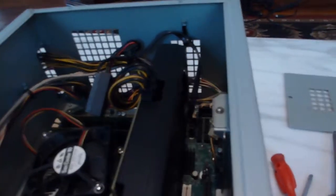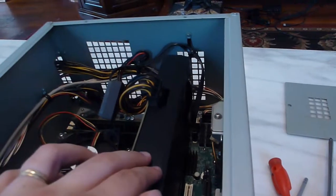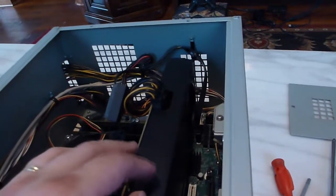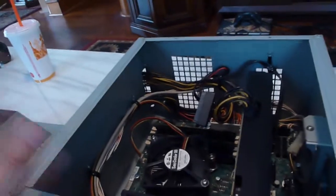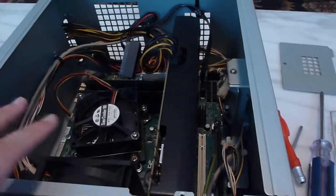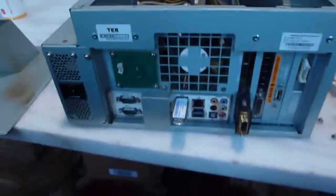It's actually a pretty impressive system considering it's an i5-3550 and a GTX 760. I'll post the specs of the video RAM when I find that online — I'll take the pictures I have and check those chips to see if it's the 2GB or 4GB edition of the card. I couldn't see Namco using something crazy spec'd out because this game runs on Unreal Engine 4, so it doesn't need crazy PC specs. That's basically the Namco System ES3 board — there are six SATA slots but it's only using one for the hard drive.